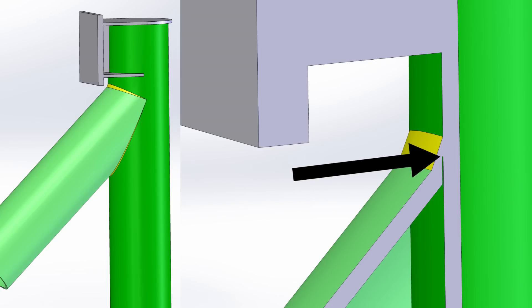That pretty much leaves us with the structure being inadequate. I don't like that tube-to-tube joint — I don't like many tube-to-tube joints, for the record. As they come together, you can see here when I take a section that there's very little holding the two tubes together. It's a very thin section of weld that has very little penetration between the two. Not a good design.